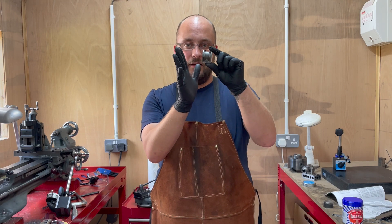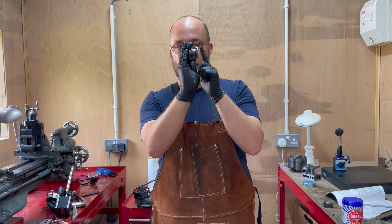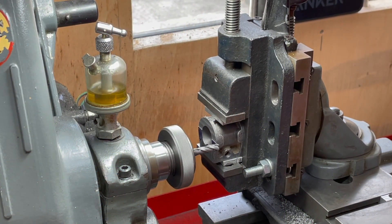What I can do now is put that in the vice in the vertical slide like that, and I can use the milling cutter or a slot drill to very gently face off the last few thou on that side to even it out.